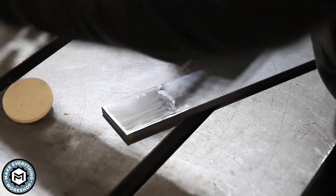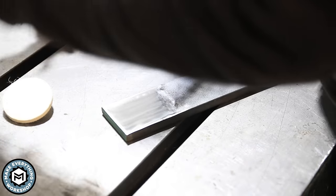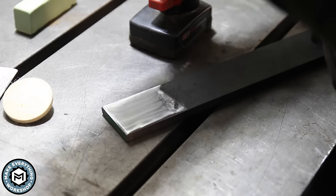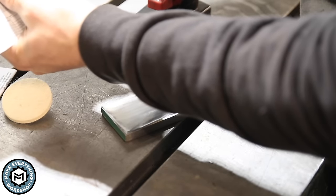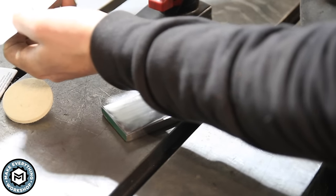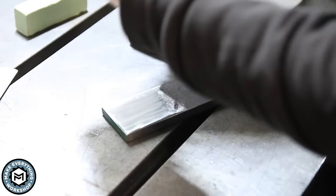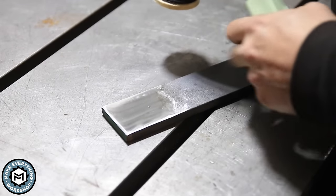What I like about this little set is that it comes with some polishing compound — a light green polishing paste. If we go into their little book, there's a chart that talks about the type of cloth ring and the type of polishing you're doing, and it tells you what to use. For steel, we're going to be using this green compound. We'll get that loaded up on the pad and keep our grinder at about 10,000 RPMs to bring this up to a higher mirror polish.